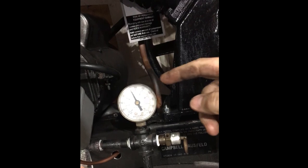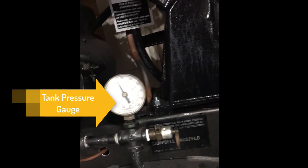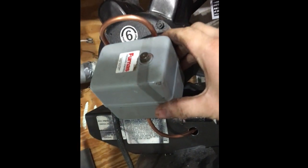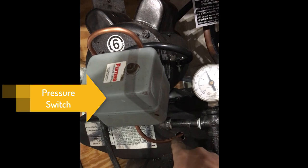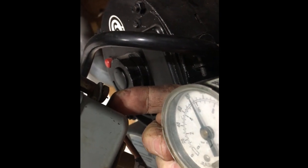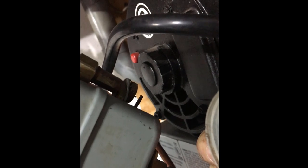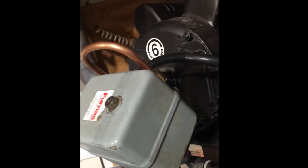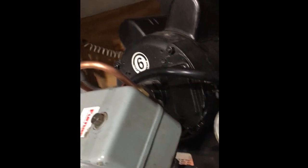We can read the pressure inside the tank — right now it's holding at around a little over about 85 PSI. This box right here is for an automatic start-off. It's able to sense the pressure through this tube that comes up and wraps around to a shutoff switch. As that pressure builds up, this side is going to move up and eventually contacts this little pin. When it contacts that, it shuts off the power to the electric motor and bleeds any pressure left in the lines. When we run the pressure out, it causes that little pin to pop down, trips the circuit, and it starts back up.